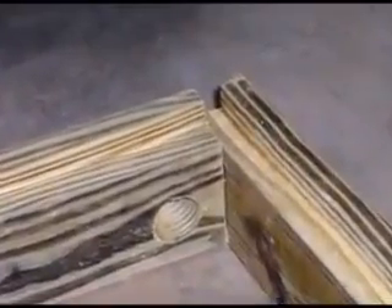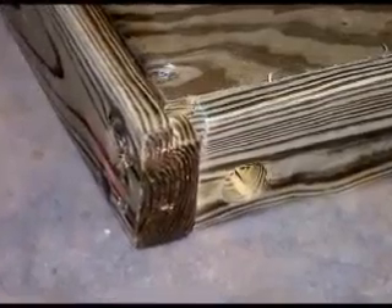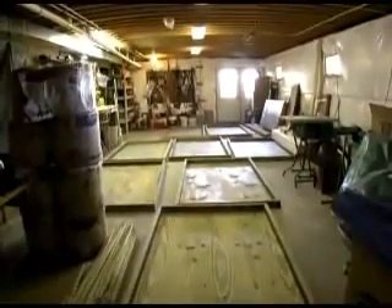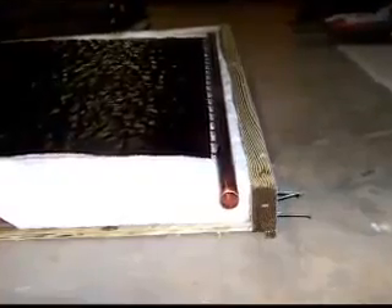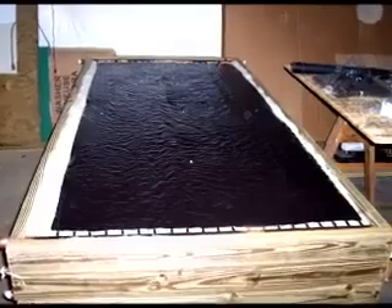For building the boxes, I cut a rabbet in the back of each pressure treated 2x4, then drilled holes where the headers will exit the sides of the panels. I assembled the boxes with screws, including the plywood back, which fits into a rabbet in the back of the 2x4s. Each box has three 2x2s running across the back of the panel, which supports the copper core solar panel and strengthens the plywood back. After verifying that no screws go through the header holes, I took one of the side 2x4s off, placed a layer of fiberglass insulation in the box, and placed the solar panel on top of the fiberglass.